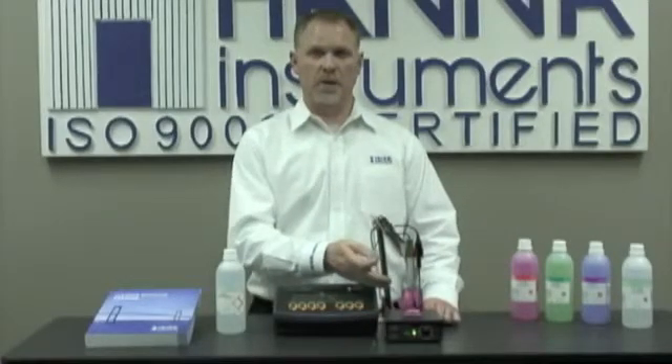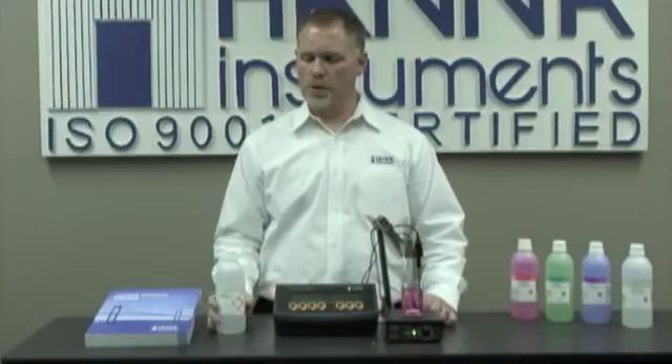On a final note, whenever you're using your pH electrode, remember to remove the fill cap — you'll have a faster response time. It's also important to maintain a conditioned electrode. You can either use a small amount of storage solution in the protective cap or leave it in the beaker. If you don't have storage solution, you can use any one of our buffers. Never, ever use deionized water. If you have any experience with drifting or erratic readings, we do sell cleaning solutions that will help you with that.